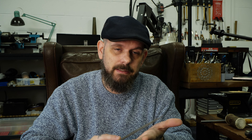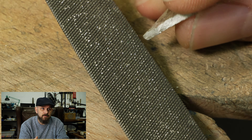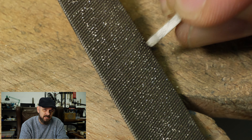After seeing this clean-up, next time you do some filing and you see those little drag marks, you'll recognise what's causing it. It's quite simply that some parts of the file get so clogged up — there's a little bit more swarf protruding — and that just wants to stick and put a nasty little burnish mark in. This method is so simple it only takes a few minutes for part of the file, maybe double for the whole thing. You can see we've got the file here with just a little off-cut of silver.